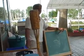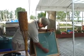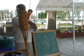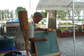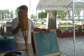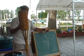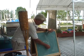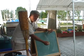The magic number, say, is 4 inches of mast bend. With 4 inches of mast bend, if you lock it into that, the mainsail has good shape, your jib halyard's as tight as you want it to be, and the sails look good. In 25 knots of air, without the ability to stop the mast from bending, you're going to get 6 or 7 inches of mast bend. The main's going to be overly flat, and your jib stay's going to get soft.